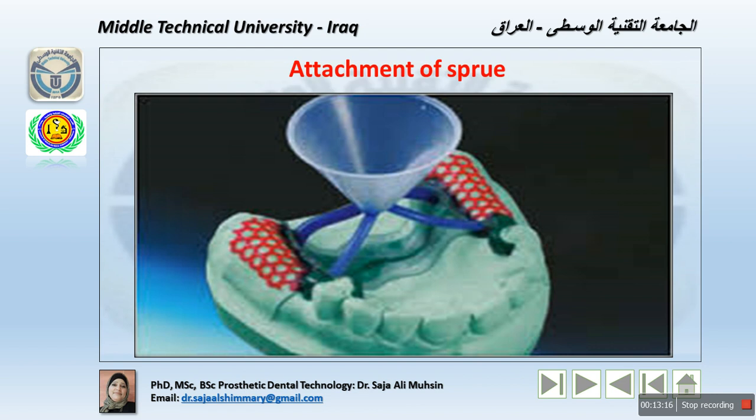The points of attachment should be flared out and local constriction avoided. If this practice is followed, the sprue, which is bulky enough to freeze after the cast framework has frozen, will continue to feed molten metal to the framework until it has entirely solidified, to provide sound metal in the casting proper without shrinkage porosity.